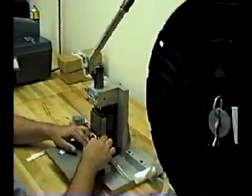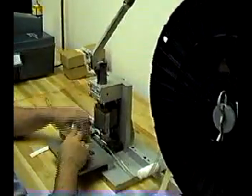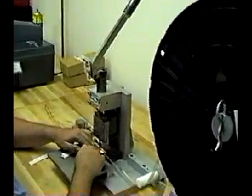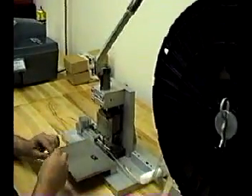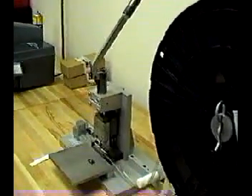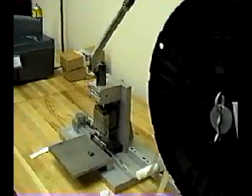While it takes a little bit of getting used to, once an operator has tried it for a little while they become somewhat proficient with it, and can get rates of two to three hundred crimps an hour from this machine on a simple little part. Of course, larger membrane switches and more difficult parts to handle slow that down, but two hundred crimps per hour is not unusual — more of a typical speed.